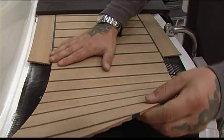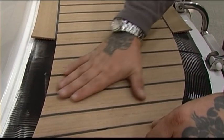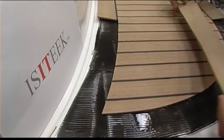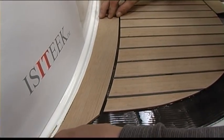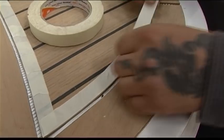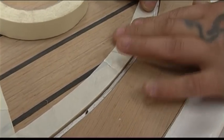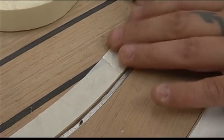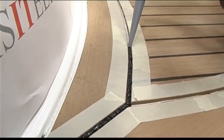Apply the glue and spread evenly. Roll the panel down into the glue and avoid air pockets. Smooth the panel out with your hands or with a roller. Add necessary perimeter margin planks, making sure that there is 5 mm between the pieces. When the panel is dry and the glue has set, mask up the areas to be caulked carefully with masking tape, leaving the tape 1 mm from the edge.